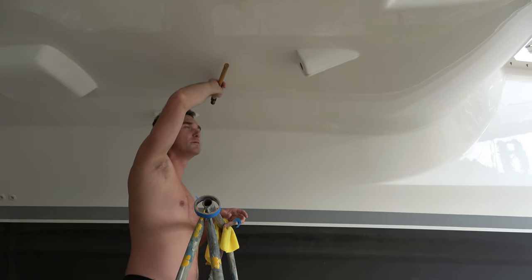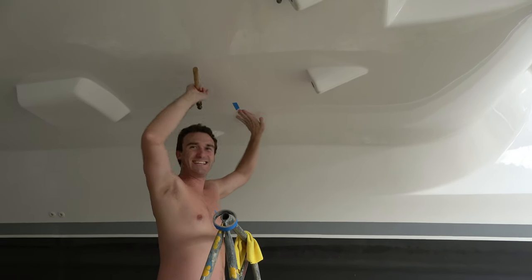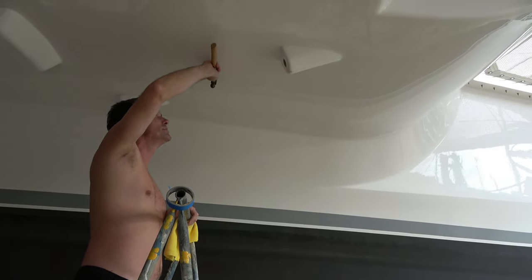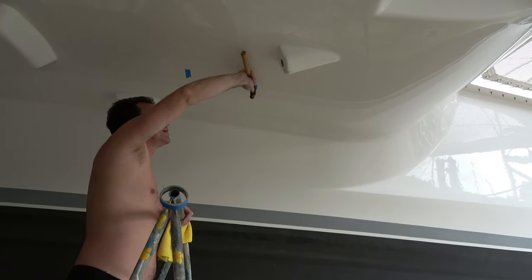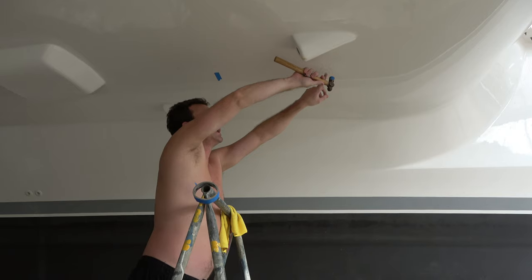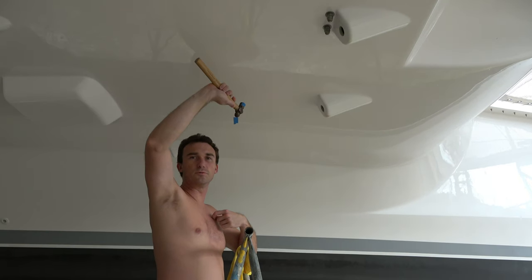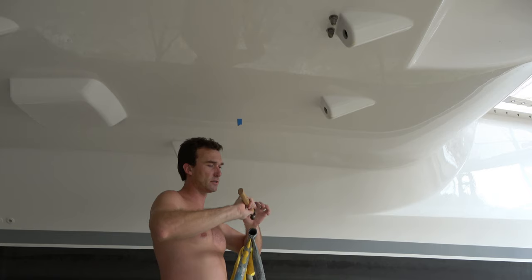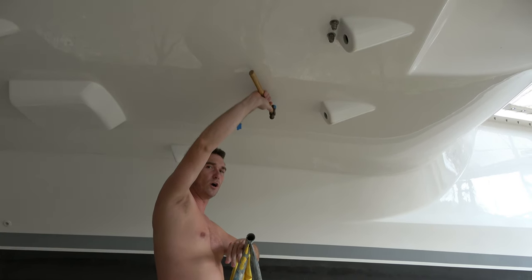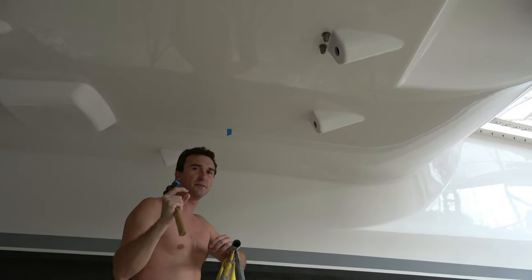Wayne gave me permission to do this. His exact words were that there's probably nobody better to go over his boat — he trusts me. That's dry — it's got blistered. As we come down here, we've got a full-on blister. I'll put tape at both ends so you can see the extent. I don't believe there's enough resin here either. You've got a normal rebound sound here, but here it starts getting more hollow, and the hollow sound is in the actual first layer.